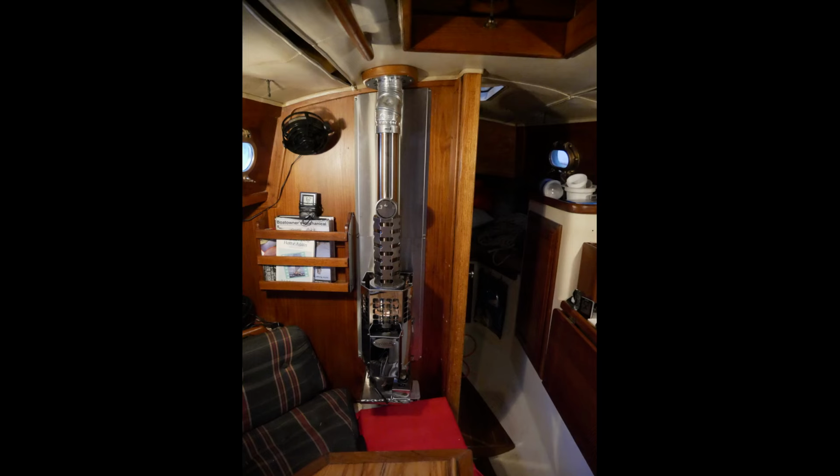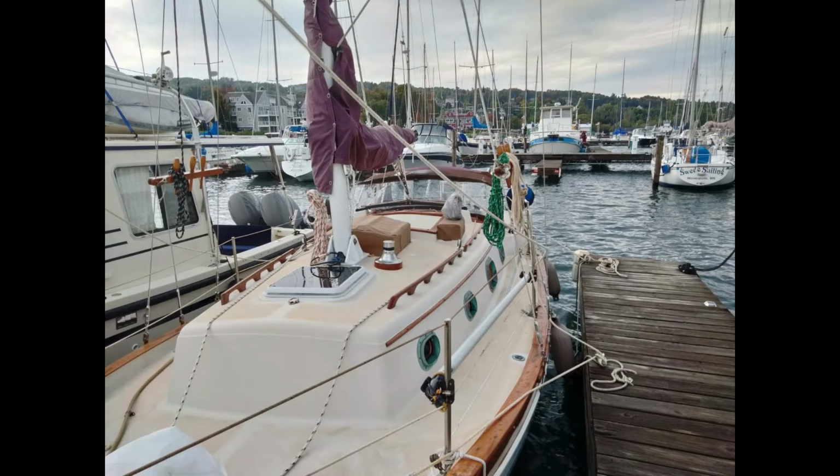Okay, so now, what about the deck? Ideally, the Charlie Noble, or where the stovepipe runs up out of the cabin and onto the deck, should be out of the way of boat handling tasks. And since I need at least 4 feet of stovepipe for draft, there will likely be an extension of stovepipe while this stove is being used, going up a ways from the deck. So now, what about the deck space?